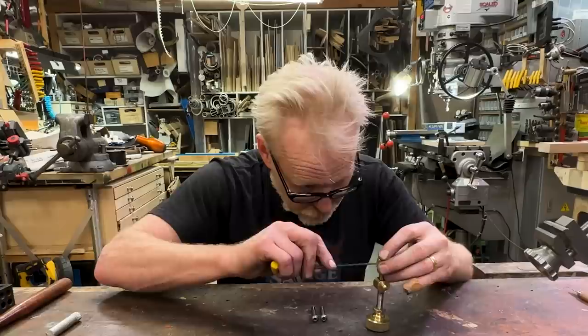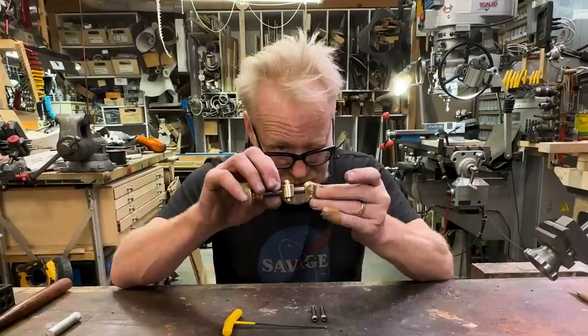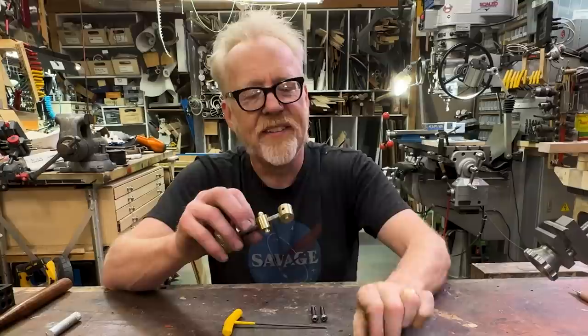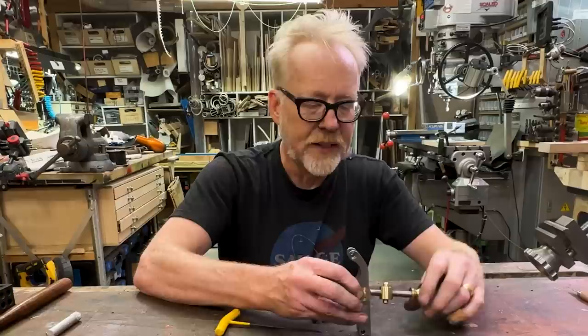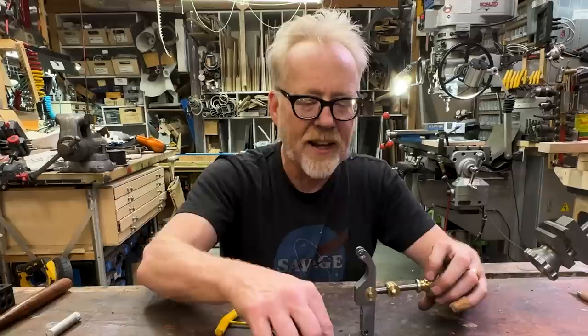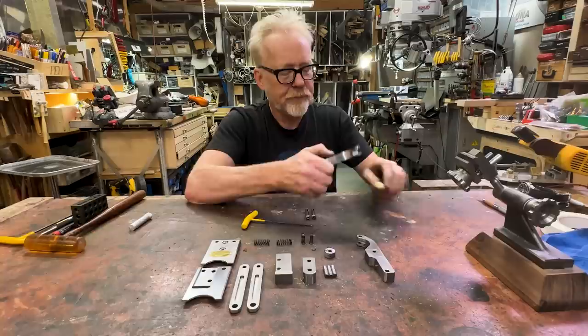Great. The real trick here is that that capture screw can't be proud of the outer barrel of that plug because it sits inside this piece. And the reason for that will be really clear very shortly. So this is one of the jaws that does all the clamping. This is the jaw that takes the force from these plugs moving apart and applies it out to the wheels. So actually, why don't we put in the wheels first? Because like I said, I have many different kinds of wheels.